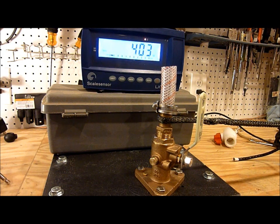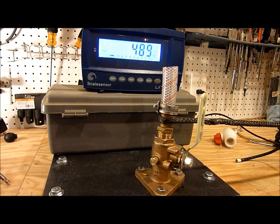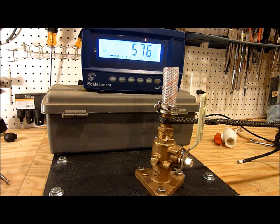We're at 340... almost 400 pounds. We've got a little bit of line stretch when I let the winch go back — could be just slipping on the winch. Now we're creeping upwards of 500 pounds. The winch is slipping a little bit. Let me get this over 500 and see if I can get her to hold there. There we are at 500. We're well over the ABYC limit, and remember, this is just drilled and tapped bolts into half-inch fiberglass. Not only is the seacock handling the 500-plus pounds — we're grossly exceeding what ABYC wants to see.